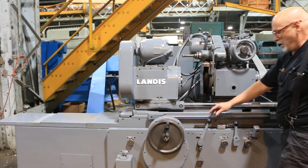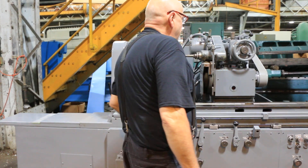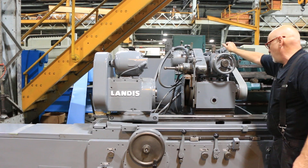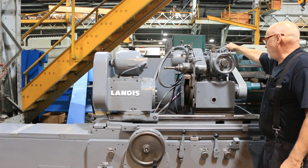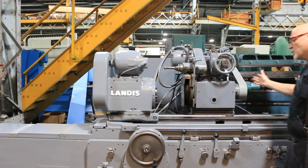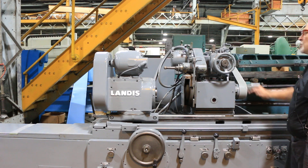You also have a fine feed hand wheel you could use to position your part or do some parts by hand. There's hydraulic positioning up here where you can move this slide forward or backwards. This is not a set movement — the operator has to control how far in or out they want to go. This particular model doesn't have a rapid in-and-out like other models.